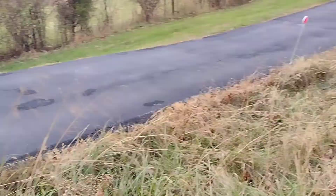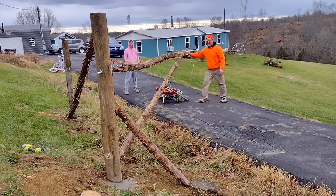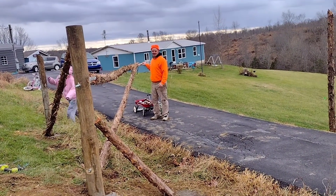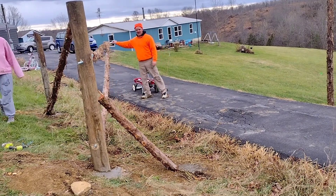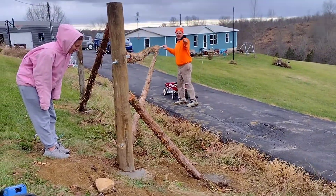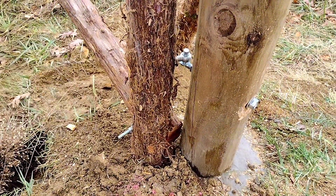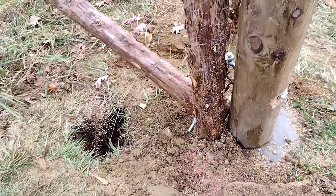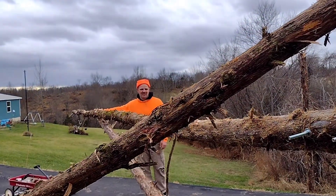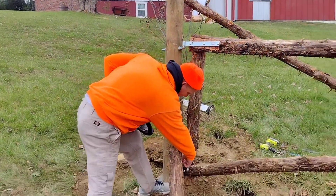Back up, camera lady, that way. Redneck, redneck, redneck. Now — is it binding on itself? Could you go check? Am I binding? Where the pieces are touching. I think I am. I might have to do some trimming from the bottom — do you see it? Okay, I'll let you come up — it's binding. I'll be able to back those screws out to give me more room. See how it's binding there — it's pinching; the wood's right up against the other wood. I'm going to hold this and see if I can adjust those out without completely taking the thing down.